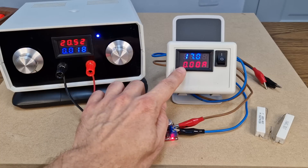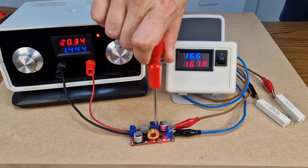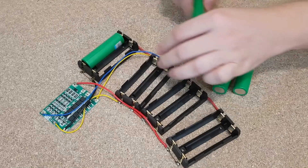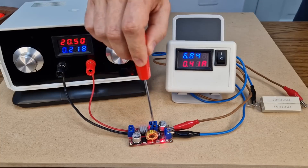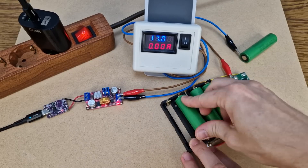This volt-ammeter will measure the maximum voltage and current going to the battery. Let's connect the battery and adjust the charging current. With a maximum charging current of 1.7 amps at 16.9 volts, the converter draws 1.51 amps from the charger — an efficiency of 93%. The current consumption from the charger is below 1.67 amps, so it should be fine. If you add more cells in parallel, this charging current of 1.7 amps is good. But because in my test I'm using only 4 old cells, I will decrease the charging current to 1 amp, which will draw only 870 milliamps from the charger.